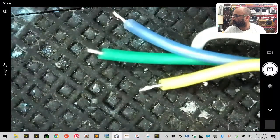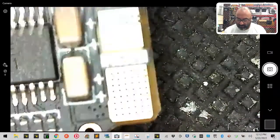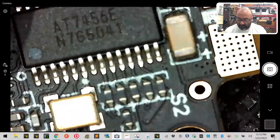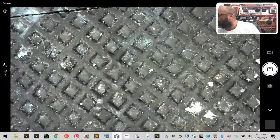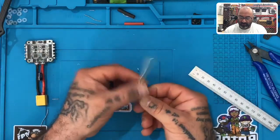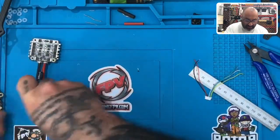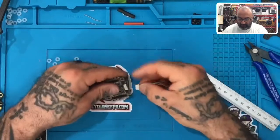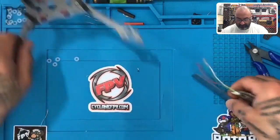Let me show you the end result. Here are the four wires now — yellow is still the longest but you can see the white one we just cut. When I go to one of these pads and solder this, you can see the wire stays within the pad range. So cut yours down — make sure they are that length for the four colors: white, blue, green, and yellow. Red and black are good. With that done, take this and plug it back into your ESC just like that.